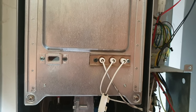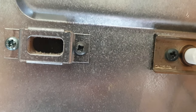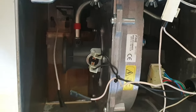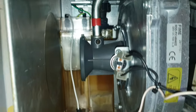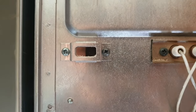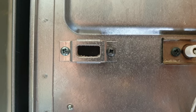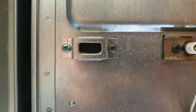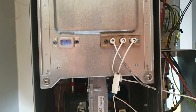There is a common fault with this and it's normally to do with the condensate trap or blockages. In this case, it's flame rectification to do with the condensate trap. That white wire leads to the flame rectification — we've disconnected it and we're going to see if it starts now.